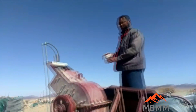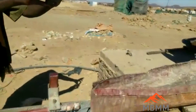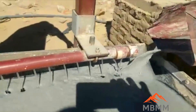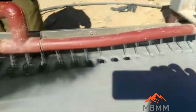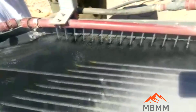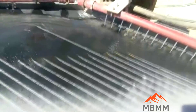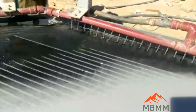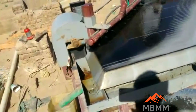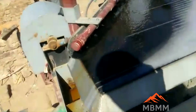We've moved to another site farther north in the country. They're also running a 16-inch by 12-inch hammer mill down onto one of our 4x8 shaker tables. The customers are testing the recovery of our shaker table and hammer mill against sacks of ore, comparing it to wet pan mills using mercury. What they found is our system recovers about two to three times more gold than the wet pan mills with mercury, which only recover about 30 to 40 percent of the gold, whereas we can recover about 85 percent with our table.